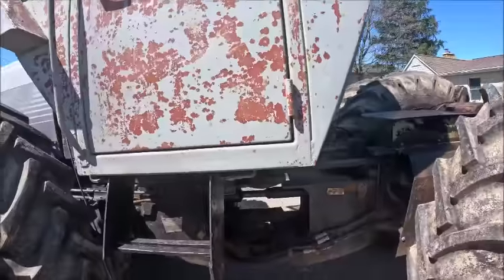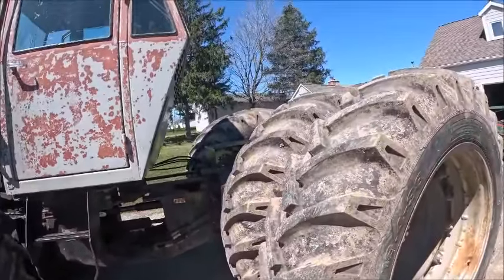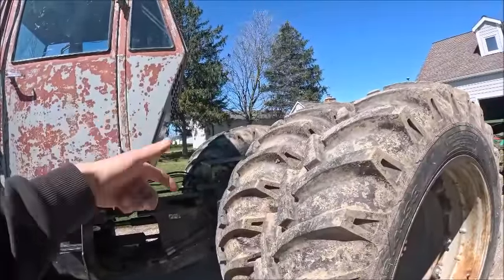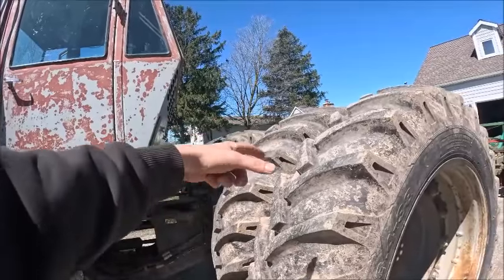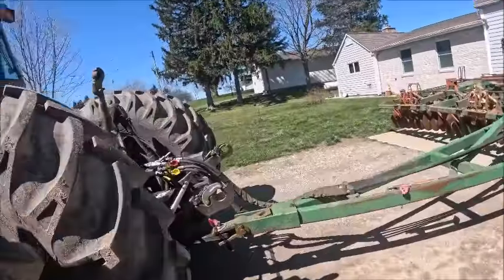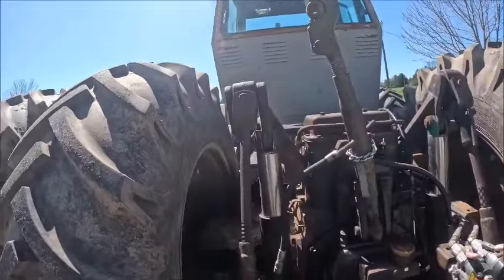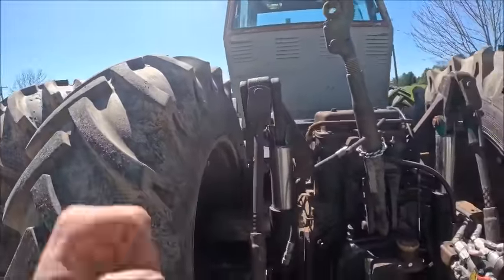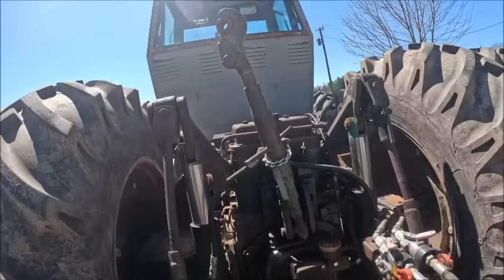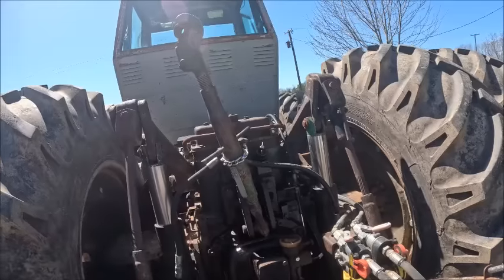It is still being all the 4150 it could be, because anybody that was following along last year, it was transferring 80-90 from the rear gear case into the hydraulics, and I thought I had it fixed when we went through the cooler pump, that gerotor pump in behind the main hydraulic pump, because it seemed to quit. Well, apparently it didn't quit. And when I was servicing it, the hydraulics were over full again, and the rear gear case was low.